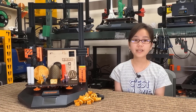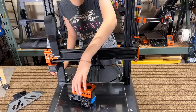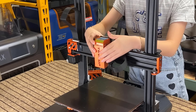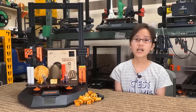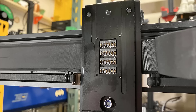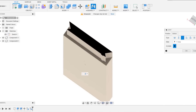Let's talk about the pros and cons of this printer, starting with the pros. One, the assembly is easy, and the modular print head and laser head design is really good. Swapping between them just requires using the one thumbscrew at the back. However, you need to pay attention to the instructions — if you slide the tool head in upside down even one time, it will damage the shrapnel connectors on the plate. If you need to replace them, they are pretty cheap and only cost a few dollars for 10 connectors. But it would be better to have some sort of anti-upside-down mechanism, like a slot or a groove, that only allows the tool head to slide in with the correct orientation.